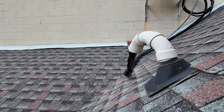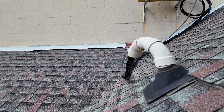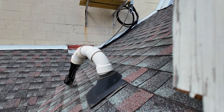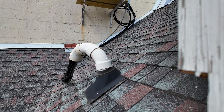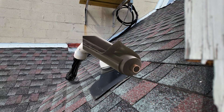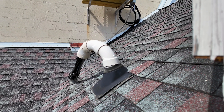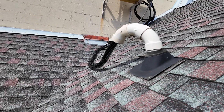Let's take a look at where the line set enters the house. There's really a lack of detail in the flashing here. The boot is underlapped but there's no silicone, no caulking, no roofing cement to detail the edges. The fasteners are already starting to rust out, and what's most concerning is the insulation of the line set. It's a six-month-old system and it's already degrading to the point where you can see bare copper. Ideally this would have either a rigid UV-resistant channel or a flexible sleeve installed at the time of the line set installation. Neither of those happened, and the insulation is almost entirely trashed — that's really going to cut down on the efficiency and longevity of this system.